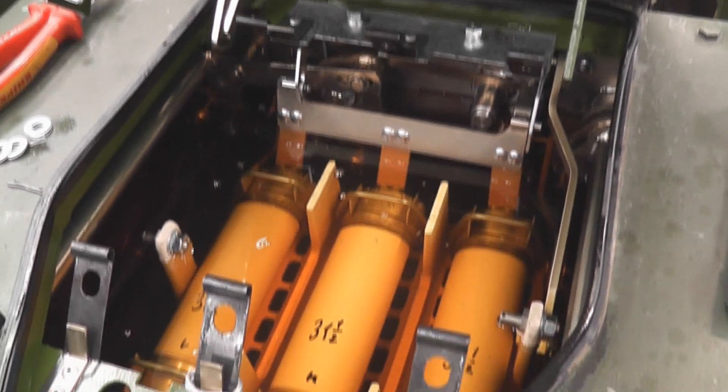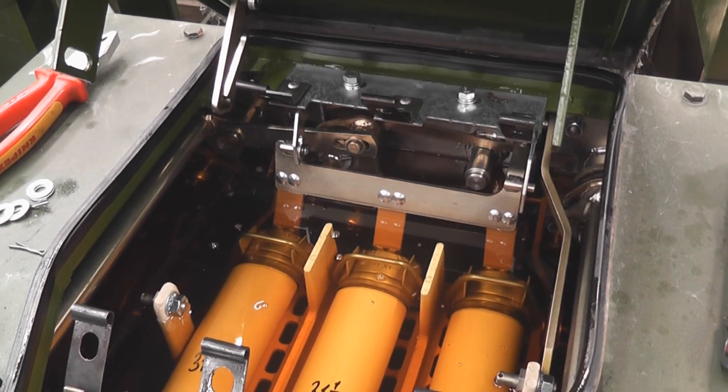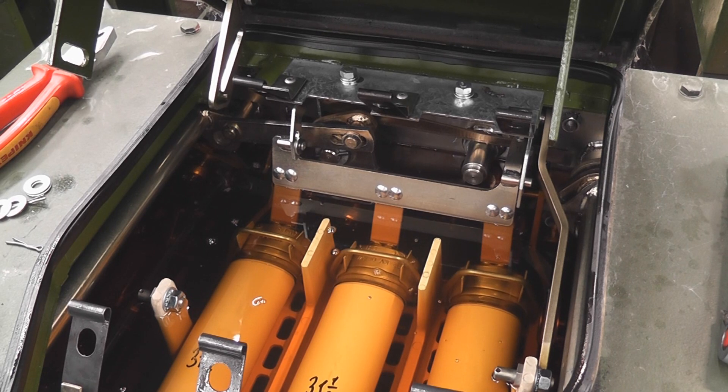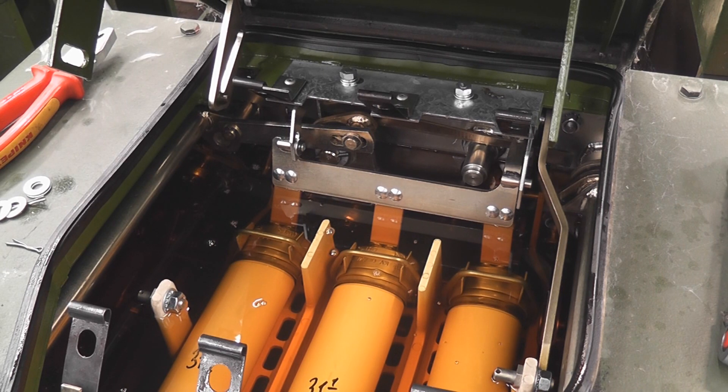I have set this thing up and hopefully my camera stays clean. This is test number one. I've got a 24 volt source at 100 ampere and a 31.5 ampere fuse, so we'll see what happens - see if it pops or not. I'll show you the setup afterwards. I've done some recordings. We'll energize the device - single phase - so the left hand fuse should operate. Hopefully.